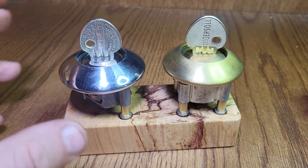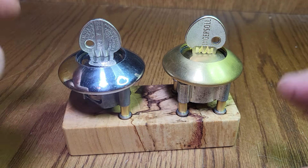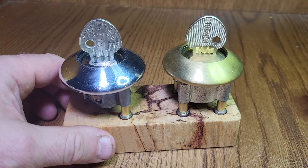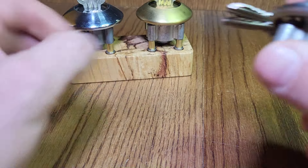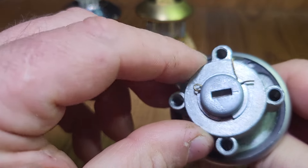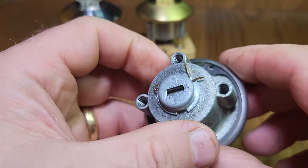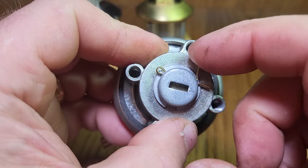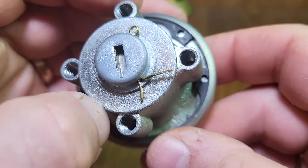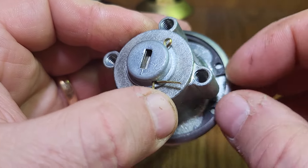I thought it could have been easier — it would have been nice to have really understood the mechanism and how it worked. One of the reasons I got into this lock is because I really liked the mechanism. But there is a problem, and I'll show you. This is an unmodified Ingersoll 10-lever, and taking these apart is murder. If you want to get the core out, you've got to take this cotter pin out here, and then you've got to undo the world's largest circlip. That really is powerful — it's an absolute pain to get off.